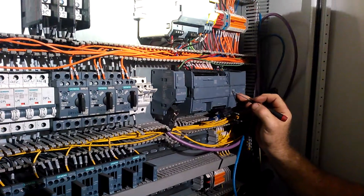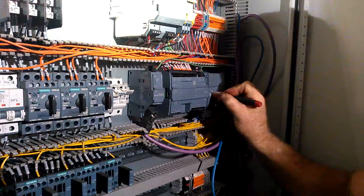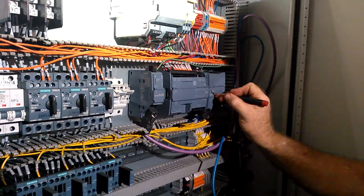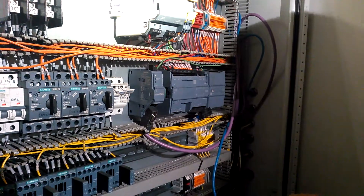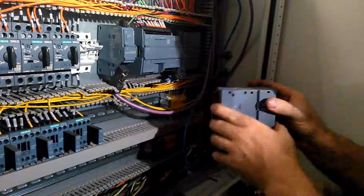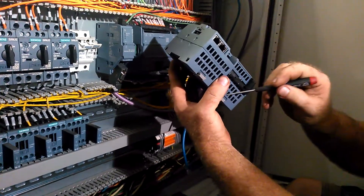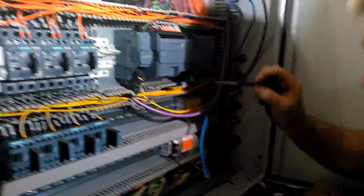This one here — use the same little screwdriver. You push in on this tab here, push in and then over. Slides out of the way real nice. Then on the bottom, connect it into the DIN rail. With these little locks, you just pop those open like that.